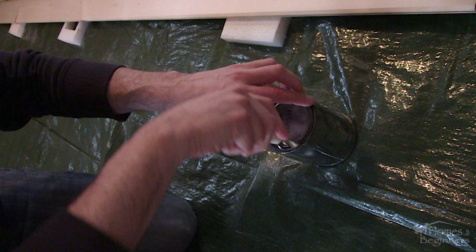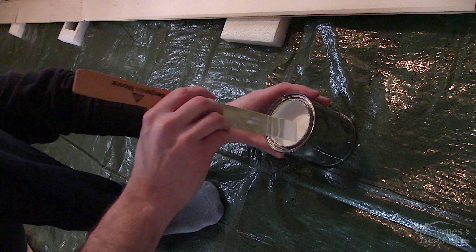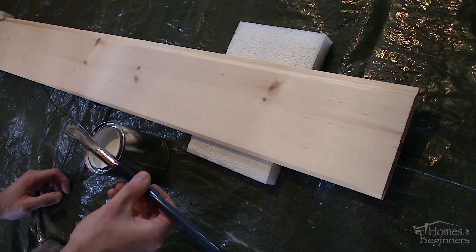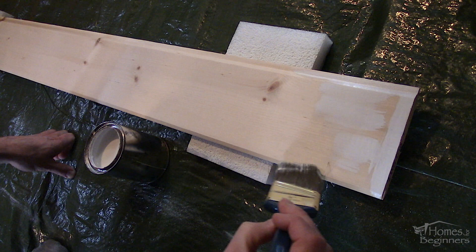For paint, this is a semi-gloss interior paint and primer mixture, from Benjamin Moore. The exact color name is Chantilly Lace, however you can pick a shade of white based on your preference. It's a water-based paint and their slowest drying mix, which gives us a little more work time during the application process. The paint is applied using a very soft brush so it doesn't show any brush marks.